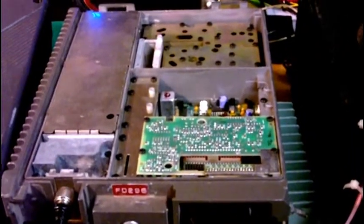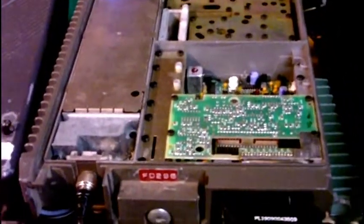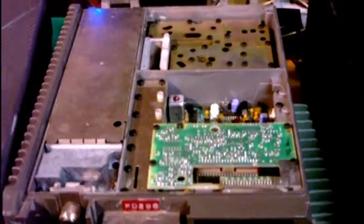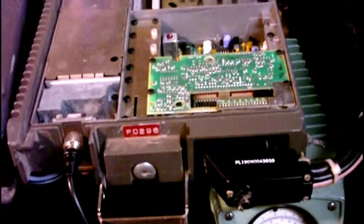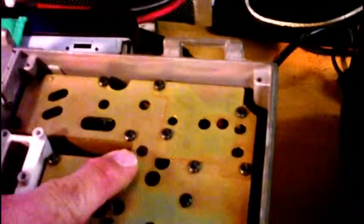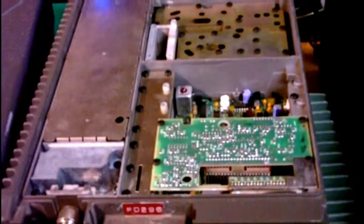A note about band splits for this radio: for VHF high band they made a 136 to 153 megahertz split, which would ideally be the one you'd want for the two-meter ham band, but there weren't many customers for that. Most people bought the 150 to 174 megahertz split. To get it to work, you have to reprogram it and adjust the transmit/receive VCOs to get them within the proper range. This one almost got to the right range just by adjusting the cores all the way down.